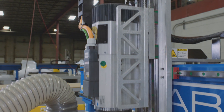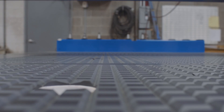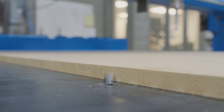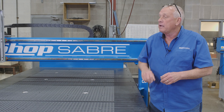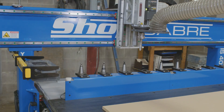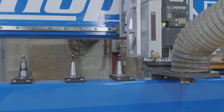All of those things go into a machine tool grade CNC router. A couple options are required for this specific application. One is a vacuum table, and because we're using fixturing, I prefer the phenolic option. The other is part locator pins. Part locator pins are the key to quick changeover — I can put that pod board on here, do my machining, take it off, and switch back over to nested base manufacturing with very little changeover. These applications use a lot of tools, so it always makes sense to have an ATC — an automatic tool changer — on the machine.